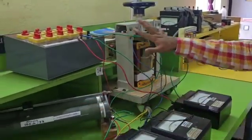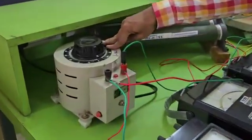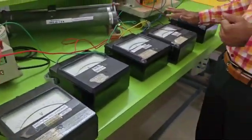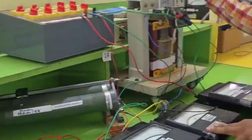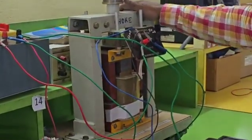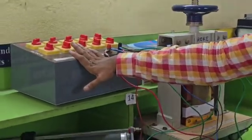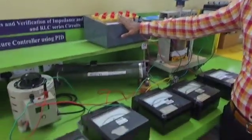This is the connection we have done. This is an auto transformer where we do variable voltages. These are voltmeters and ammeters. We don't have any watt meter in the circuit. In place of resistance we use a rheostat. In place of inductance we use a variable inductance load called a choke. And here is the capacitance load — a single phase capacitor load — which acts as a capacitance in our circuit.